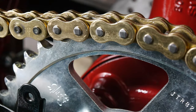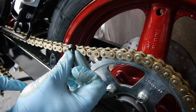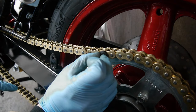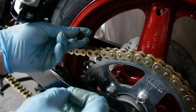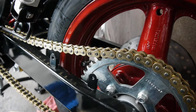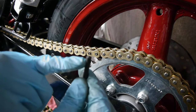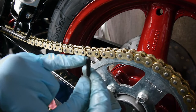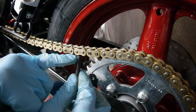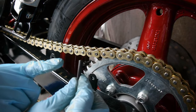Now we're going to set up the tool for squeezing the rivet. On the back side we're going to be using this little anvil with the indentation — the larger one which fits over the rivet but rocks back and forward so it's not touching the actual plate. On the front we'll be using the largest pin in the set. It's got a little hump in the middle and is flat out at the outer edge. Once the pin spreads out and goes over the hump and hits the flat spot, that's as far as you need to go — any more than that you're not doing any good.